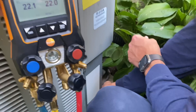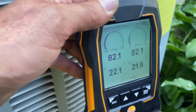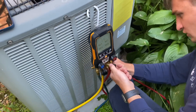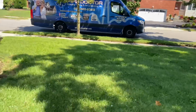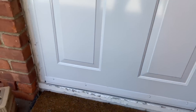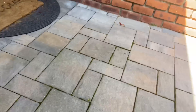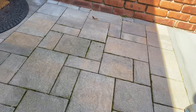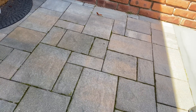Why do I hear leaking? It's coming from here. Alright, pressures are balanced. We don't have enough refrigerant in the system. Let's go tell them the great news. Yeah, okay — you don't have enough refrigerant in the system. So is that leaking? That means you have a leak.